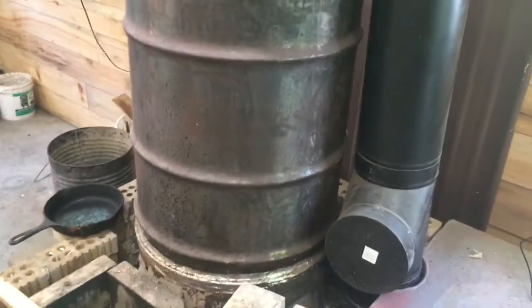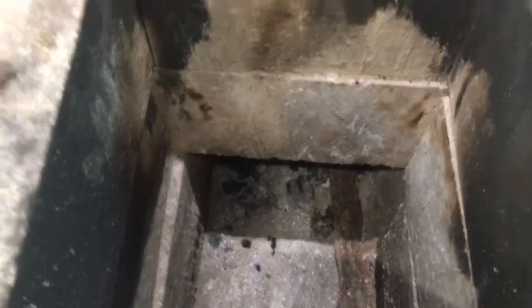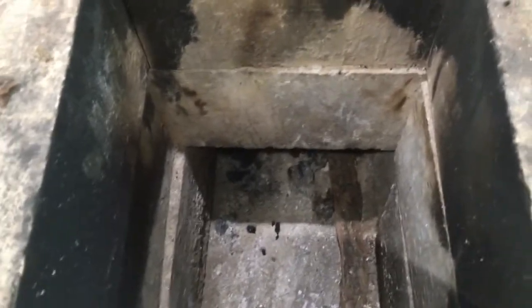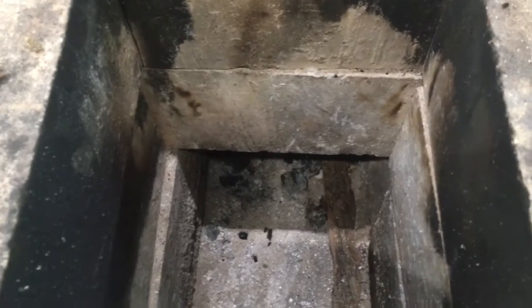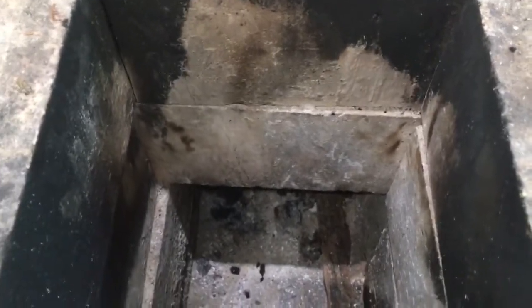Here's another common problem: after two seasons of burning I've cracked the top brick in the bridge on top of the burn chamber right here. I've replaced it four times — this is the fourth one in there now, and it's cracked again. I started researching and thanks to your chats I'm a little more versed, but still no expert in materials. Do you replace it or just leave it? Being dry-fit makes it easy to get in and out to replace it, but I'm apprehensive about sealing everything up and then having to replace a mortared-in fire brick.